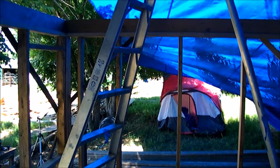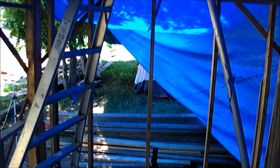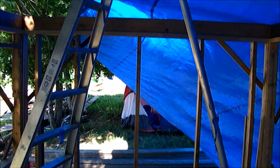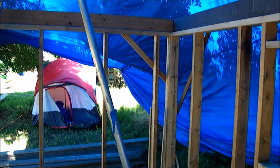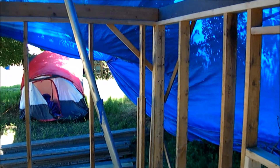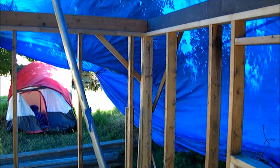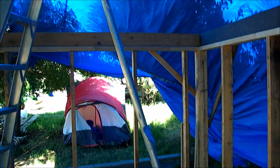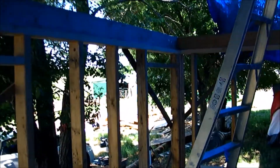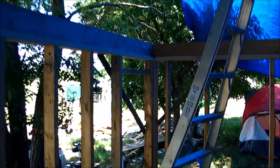We're going to use the floor joists for the loft, which are also the ceiling joists for the lower part of the ceiling — not the vaulted ceiling but the lower ceiling on the lower level. These loft joists are going to tie together the walls at the right exact width of 102 inches from one side to the other. They firm up the rim joist, and placing a little piece of plywood temporarily on top of them will give us a place to stand while we work on the rafters for the roof.